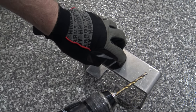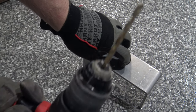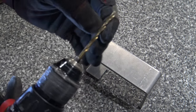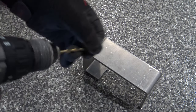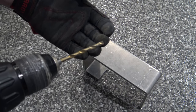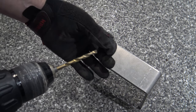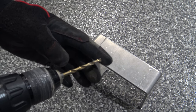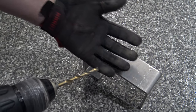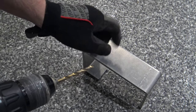Alright, I have this quarter inch aluminum and my drill bit all chucked up — this is a 5/16ths bit. Just watch the chips: a good drill bit will expel the chips out of the hole. If the chips stay in the hole that causes a lot of heat on the drill bit, so a good drill bit will have chips coming up out of the hole.